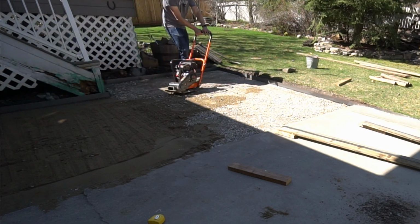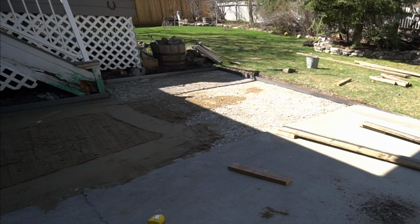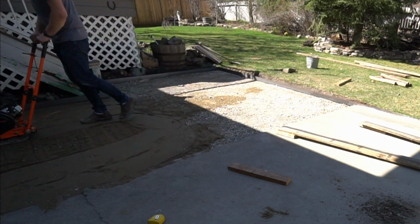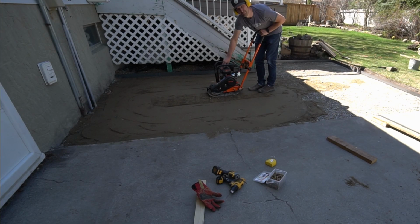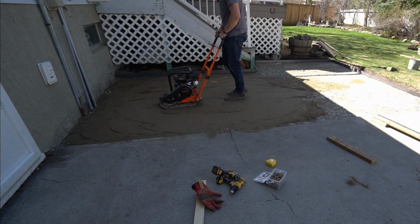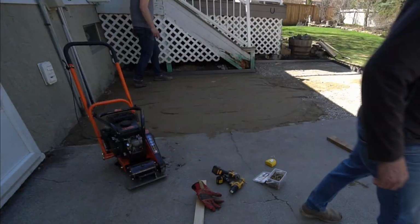When you're compacting sand, you have to move smoothly with the compactor. If you pull too tightly or use an edge to pull back, you'll just pull the sand out of the way. Another thing to ensure is that your sand is a little bit moist. Dry sand will not compact at all. The problem is, saturated sand won't either. It has to be in between. This might have been a bit dry, but you can always take out a hose and spray it down for this compaction step.